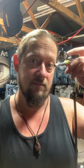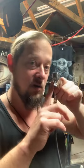The way this works is you put your material in here. Currently I have water in it - totally just water, non-toxic. I cleaned this out yesterday because I clean them out every day. You need a way to provide your airbrush gun 25 to 30 PSI consistently. The reason I say consistently is because there are a lot of small compressors out there - they'll give you 30 PSI and as soon as you push that button it drops to about 15, and that's not enough. You need that 25 to 30 consistently.